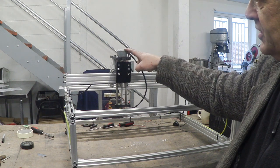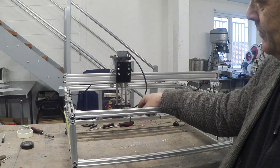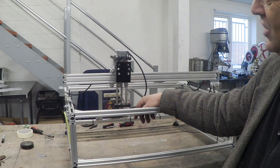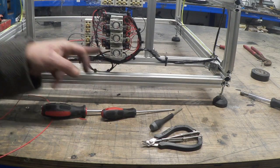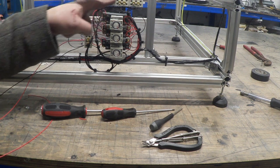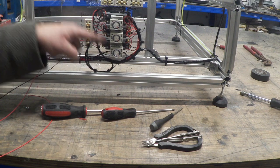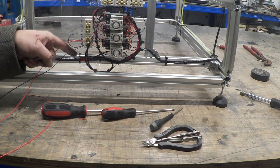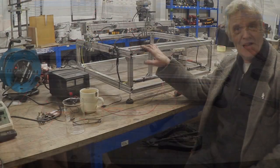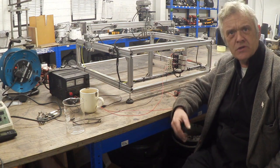I chose 10 rpm because it's the first time I've made this, though I think 10 is a bit slow — I may go for 100 to speed things up. It is nice and gentle, and I can just set the number of cycles I want and leave it alone until it's done. Here are the relays, here is my relay block where the Arduino signal goes in, here's my sensor bar for the sensor wires, and here are the relays responsible for reversing motor direction and tripping the limit switches. This is just the live and neutral in — that's really all there is to it. That's the space for the Arduino — a SILAR machine to do nanoscale experimentation using a macroscale technique.